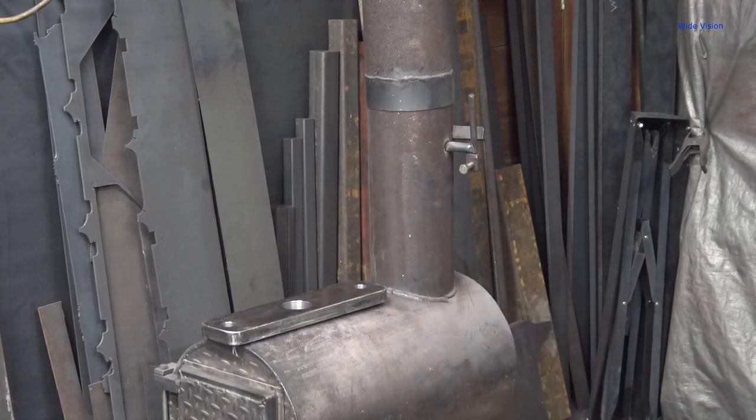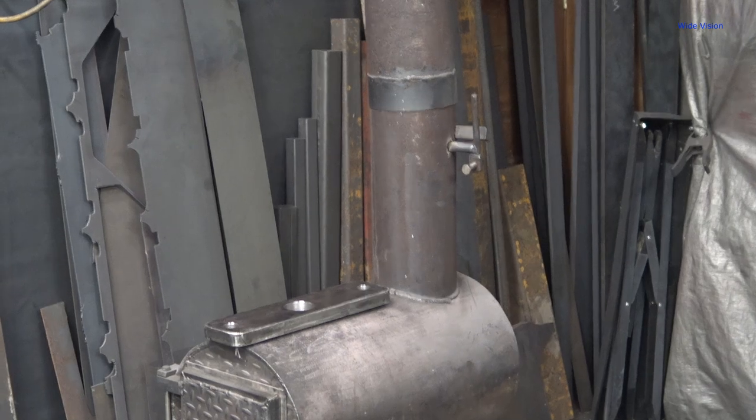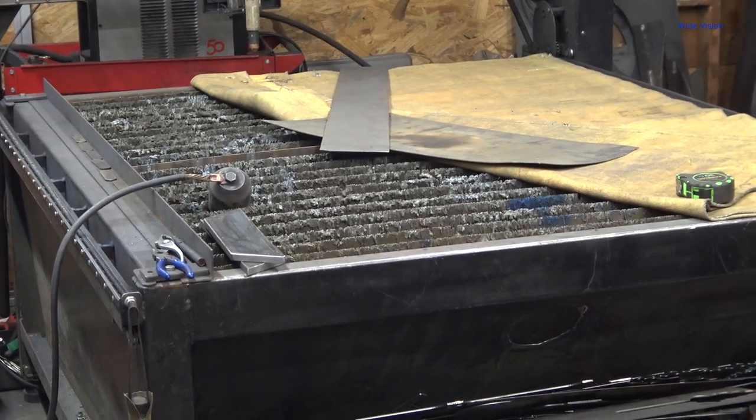to warm this plate just a little bit so when I go to welding it's not welding a block of ice, because I just took the temperature of the floor. The concrete floor of my shop is 34 degrees right now. That's been laying on the floor and it is cold, so I've got her up to about 103 right now, and I'll take it off of there and we'll set it over here on the plasma table. We'll get everything clamped up and start welding it together.